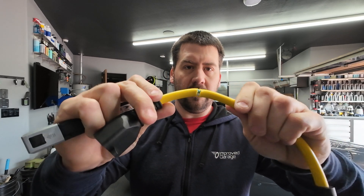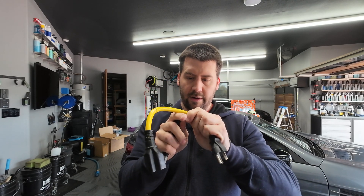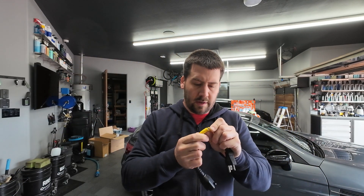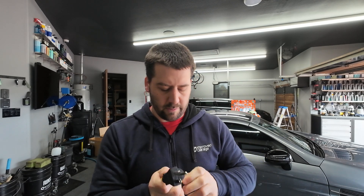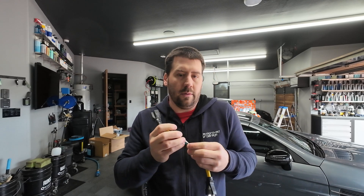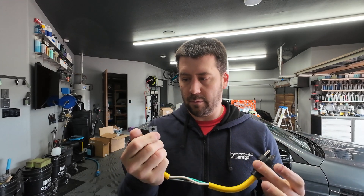Now we've got the casing scored all the way through, and we do the same thing a couple inches down the wire. We've completely gone through it in two sections, leaving the insulation of the underlying wires untouched. Then we score lengthwise down the outside of the casing — being very light — and once you get an edge started you can peel that piece of casing right off and remove it entirely. You could buy wire and plugs at your local hardware store, but that costs a lot more than this did — this was a ten-dollar one-foot extension cord.